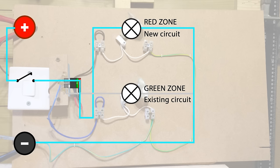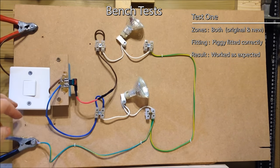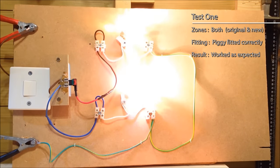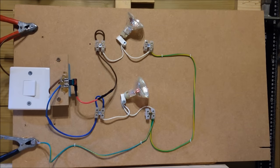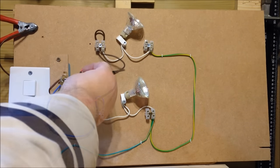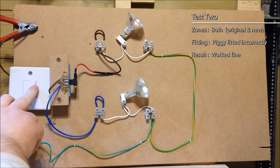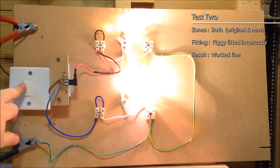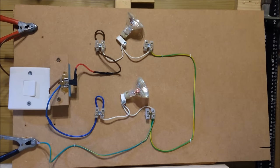So let's start off with both fuses in the piggyback holder in what I consider to be the correct way round. We hit the switch and both lamps light — which is exactly what we'd expect to see. But what happens if we swap it the other way round? Piggyback's in the wrong way round — flip the switch and both lamps still light, proving the point that it does work. But are they acting independently you might ask?